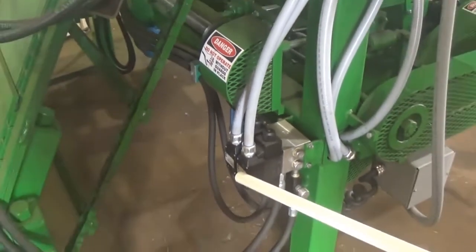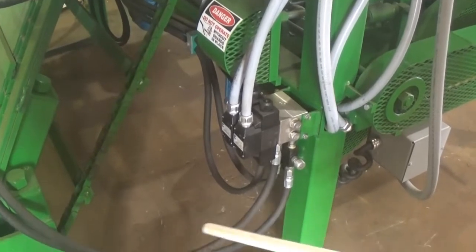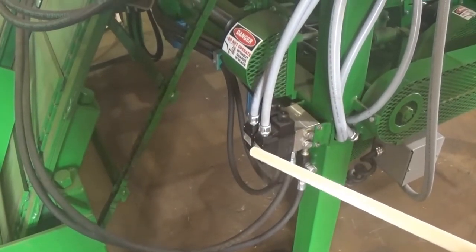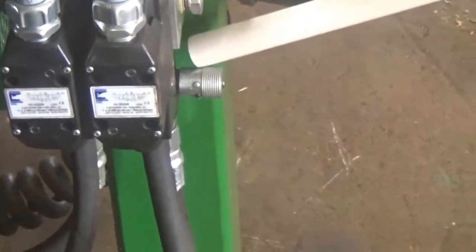Here's your cylinder valves. One controls the unscrambler, one controls the pusher, and they have lights that will light up whenever they are on. And this is the speed control — one here, one inside there — for the speed of each one of them.